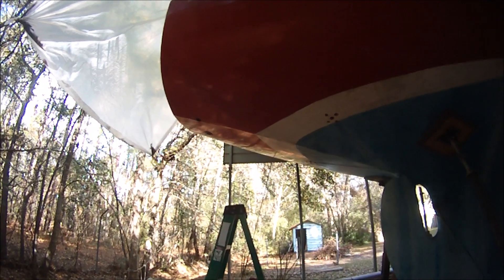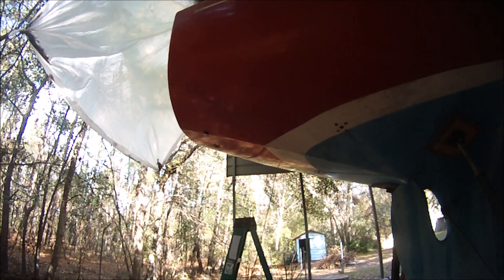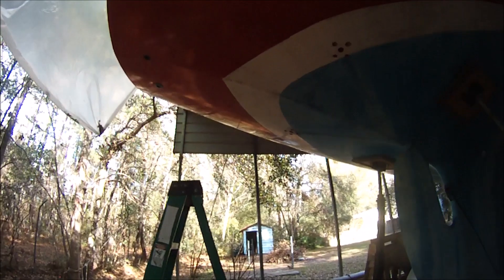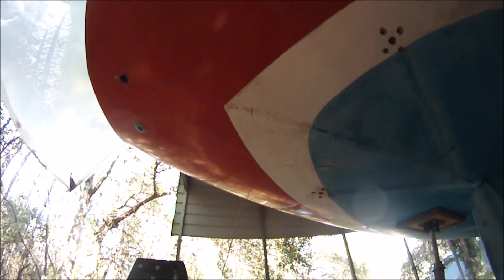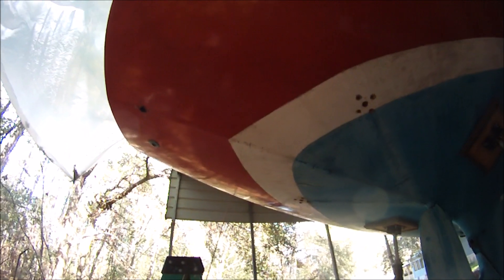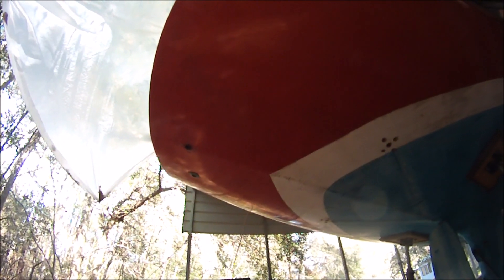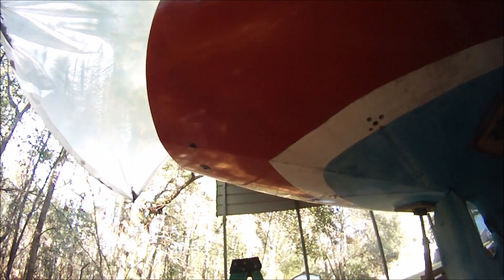This boat's a little different. It has a different angle of the hull and transom and a different amount of overhang above the water. What I've measured is from the actual waterline approximately here. I drilled a test hole there to see where it comes through on the inside, which is about four inches above the standing waterline. That will be a reference point for whether we need to move forward or aft to cut the shaft hole in the hull and the slot in the transom.